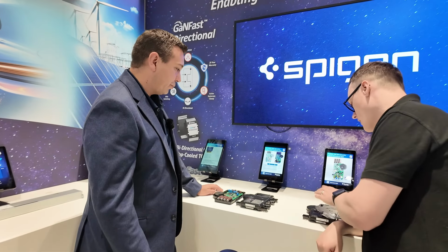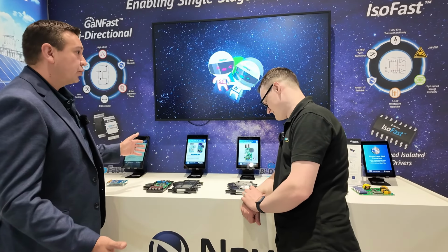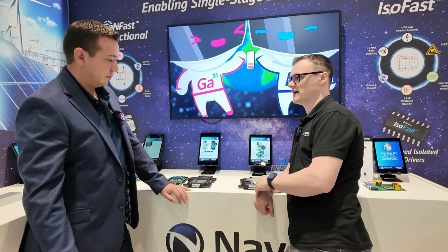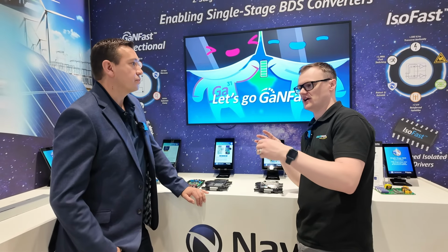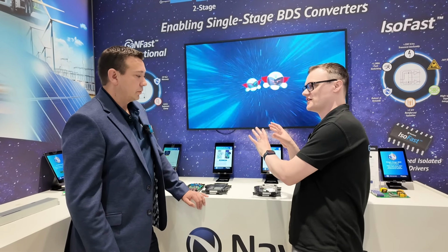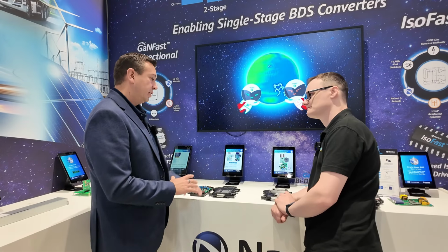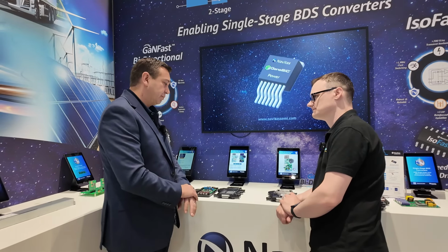Right, great question. So what application are these used in then? So these are microinverters. They go on the back of a solar panel. Yeah. So instead of a centralized one, or a string where you have several connected to one big inverter, these are microinverters. So every single panel has its own little one, and I'm guessing that helps with energy saving, because if you have a large string of them, you're going to have huge currents going through wires, which is a lot of losses. You've got to carry it from a great distance, whereas here, you're localizing that conversion. Yeah, exactly. So this is more for residential, light commercial situations where you want a modular design. And so, they both have their places in the market. This is ideally for that.